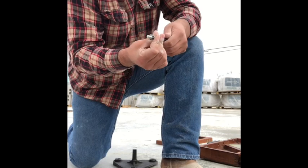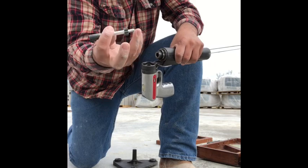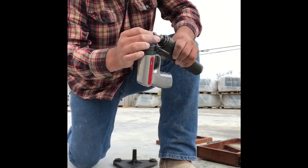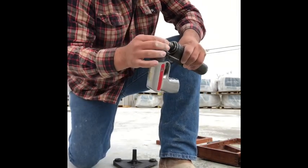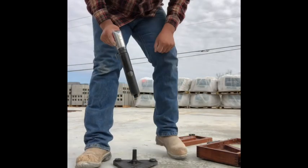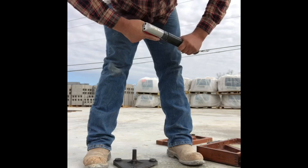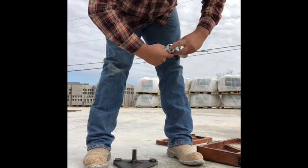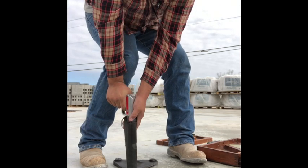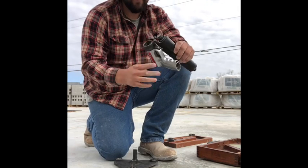I'm going to grab this little piece from the box and screw it onto the tip of the probe as far as it goes. The tip of the probe that goes into the concrete goes into the barrel first — shove that in there. Then I slide the bullet into that piece, turn it sideways, cock it, and it's ready to go. I find one of these corners, put the gun all the way down, and push it down nice and straight with two hands.